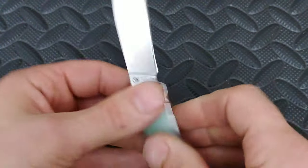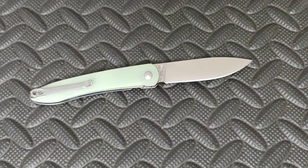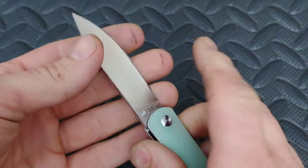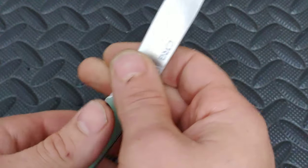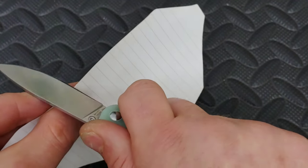This is 12C27 steel. I could have put a little bit more of a polish on it, but I don't want to keep removing steel — putting a polish on there wouldn't remove too much steel anyway. I already brought it to a really good working finish, and this is a very respectful edge. Let me do a couple of push cuts really quick — push cut, back here, up here. Very clean. It's a good edge — it's a really good edge.